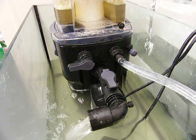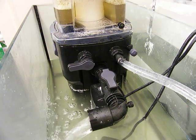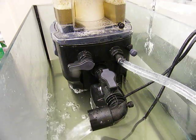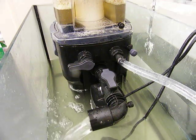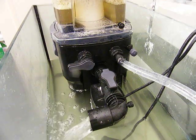The Sea Skim is supplied with a closed loop aspiration pump circulating the water through the skimmer at 450 litres an hour of air. One of the main criteria for a protein skimmer is the 3 to 1 water to air ratio, and the Sea Skim exceeds this with a suggested water throughput of 1200 to 1500 litres per hour.